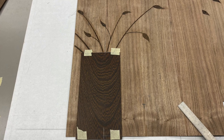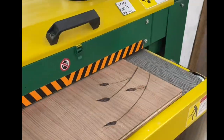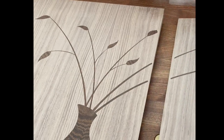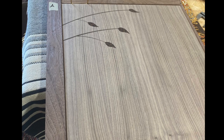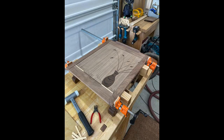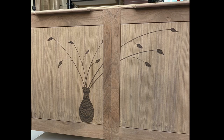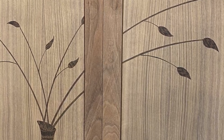It's typical to draw the complete background when doing double bevel marquetry, but I don't always do it because lines can get smudged, so I might draw as I go. A good tip: I don't always know the length of the radiuses, so I just do a little scale and write them all down — there are five different radiuses. So I've got one piece left — the vase — and this piece of wenge is very curvilinear to lend to the physical roundness of a vase. Finally, I can run these through the drum sander, starting with the back to get everything flush. My drum sander can go down to about a sixteenth of an inch without a platen. There's our motif — I'm loving the way this looks. I'm making sure I have a 3/32nds reveal all the way around the panel. I don't have to worry about expansion or contraction because this is veneer — I glued that panel in solid, which added strength. The doors are probably just about right; I've added Soss hinges on the sides. My next focus will be getting the two stems to connect with inlay going across the two door stiles and that little half leaf at the top — that'll happen in part two.